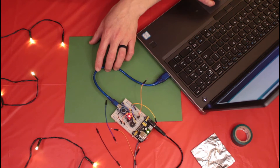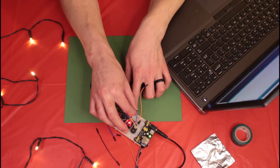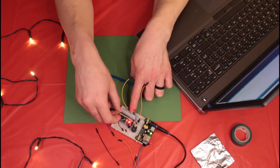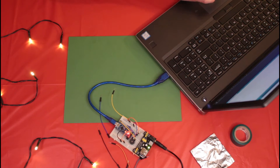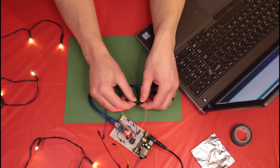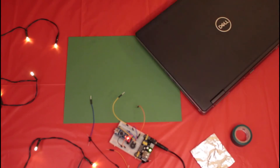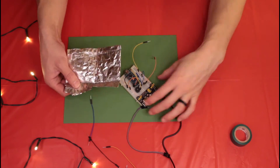Now I'm going to hook it up to the computer with a USB cable and start programming. I'll post a link to the Arduino code in the video description so you can copy and paste it and upload it to your board. There's some troubleshooting happening here which, while important, is not terribly exciting so I'm going to skip that. I have this programmed to chirp the buzzer every time the probes break contact, so if we run out of water the buzzer will start chirping every 15 seconds — not enough to be super annoying, but just enough to notice.